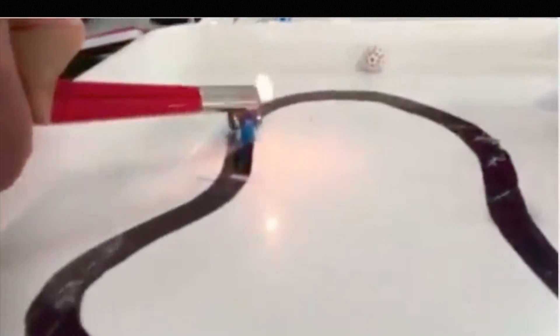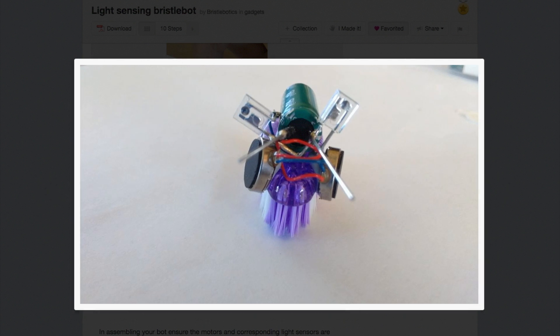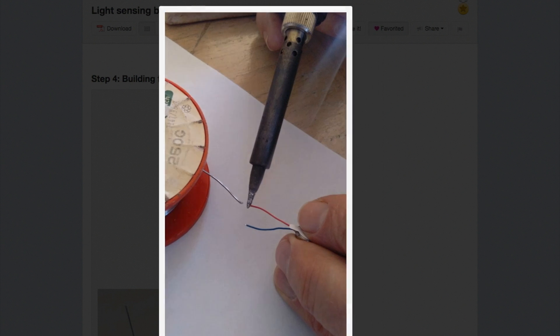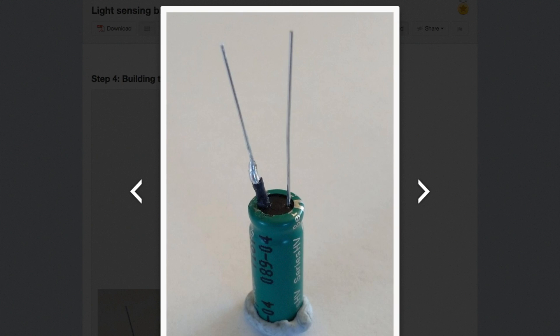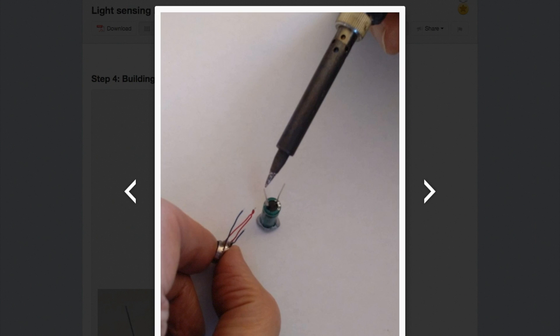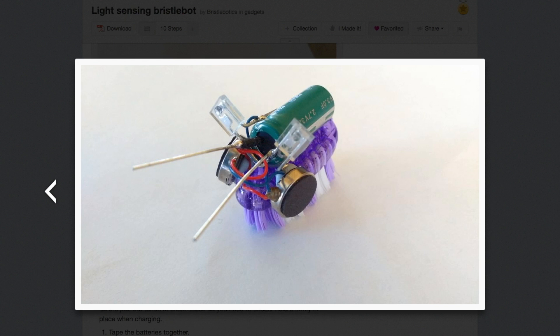Also, instead of using a coin cell battery, which can be messy to tape in or glue in and messy to take out when it's dead, this design uses a capacitor that you can endlessly recharge using a pair of AA batteries. How cool is that? Now the small amount of soldering with this design does make it a different beast than the basic no-solder Bristlebot — it's a somewhat more complicated project. That said, it still looks like a good intro electronics project for helping to teach soldering, polarity, sensors, transistors, and capacitors. And best of all, the payoff is a little bot that can be recharged over and over. It's a cool project, and totally doable.